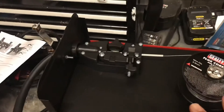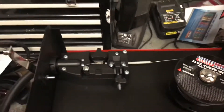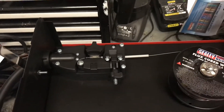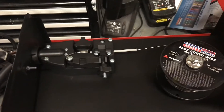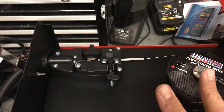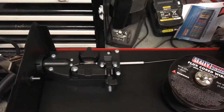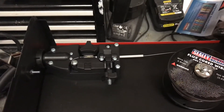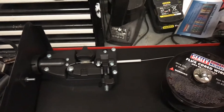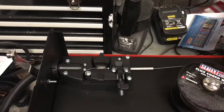I put the flux cord through — flux wire. I've got 0.9mm wire. I've been reading up a lot on this and there are various different wires, but reading on these gasless setups — 0.6, 0.7, 0.8, 0.9 — they're set up to do most sorts of jobs for home DIY. This stuff tends to work quite well for the gasless setup, not for the gas setup. If you're looking at the gas setup then the wire setup is very, very different, so I'm not going to compare the two. This is more for the gasless one.